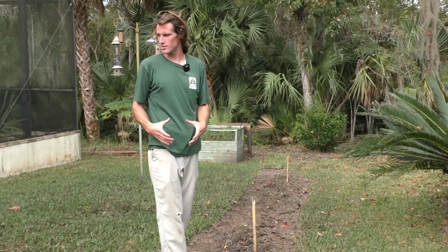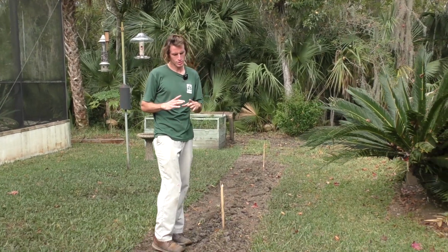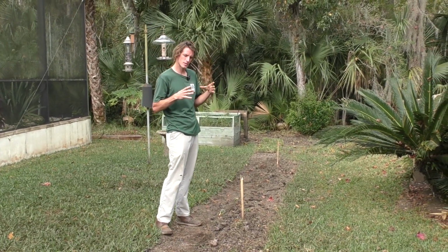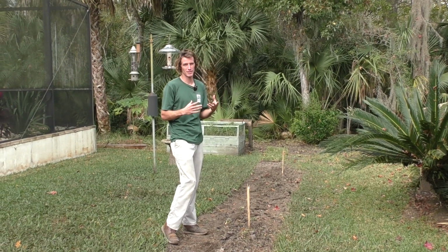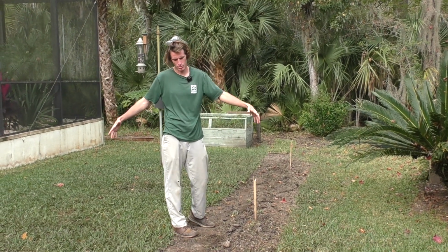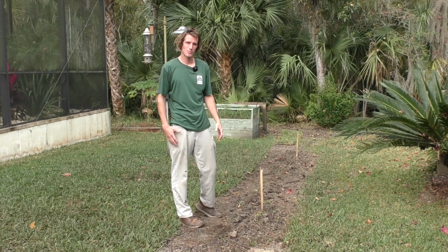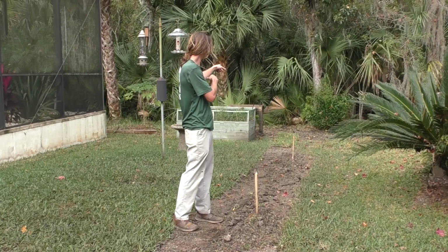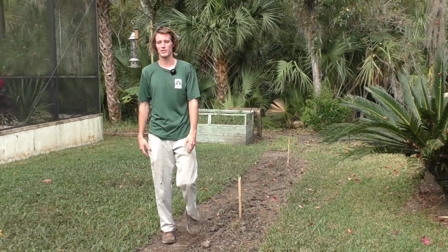Our French drain is like that black pipe, 4 inches, but it has slits cut in it, and a sock around it to keep dirt from getting in. So the water comes, it soaks into the ground, gets all saturated, and pours into that empty space in the pipe and out the box, which has enough fall to push out that box from up here.